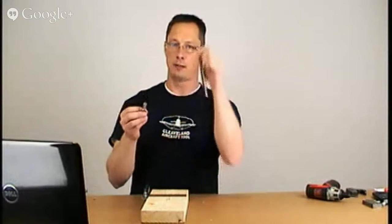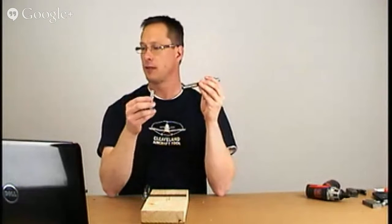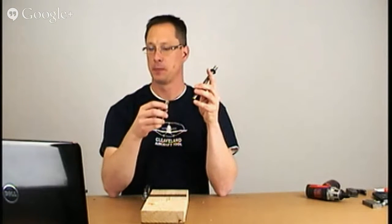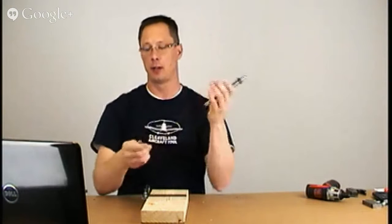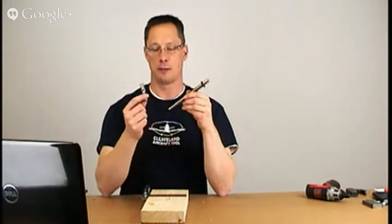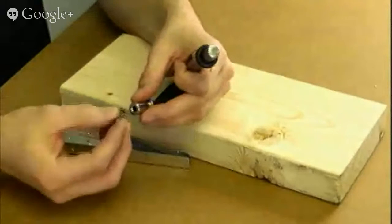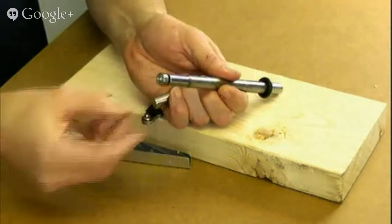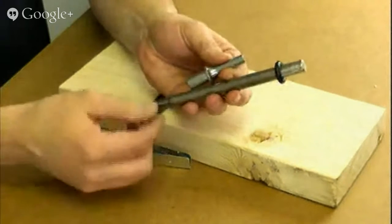These two tools are the C-frame ram that you put in the top of the C-frame, and the bottom post for the C-frame. The C-frame allows you to work on large sheets. It has a set holder with a small hole that fits the dimple die in the top, and the ram also has the same hole for the other side dimple die. If you have our C-frame, you have these two pieces.